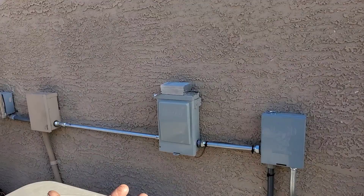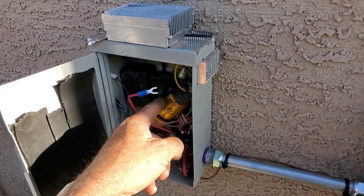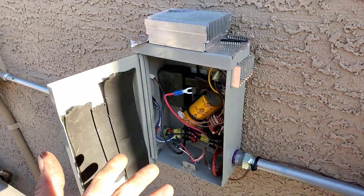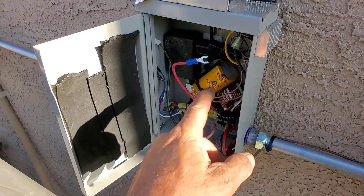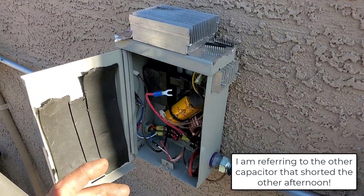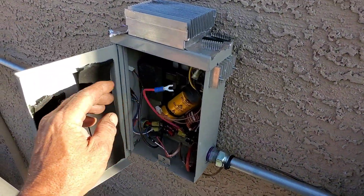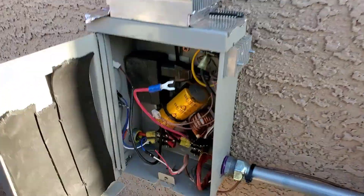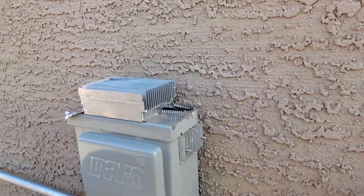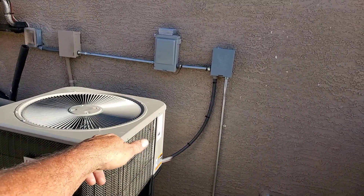Right now my electronics that I was working on are all just neutered and disconnected. Somebody was talking about the capacitor voltage being too high. Well, this capacitor comes off an LG board that's made for 208 or 230 volt input, but you get about 330 volts DC. When it's not running and the solar's hooked up it goes up to about 360 — but 400 working volts right there. Same exact capacitor. Except I had used soldering paste for pipe and it was smeared on top of it — I think it actually conducted somehow and it got that little plasma explosion. So the rectifier is all disconnected because it's shorted out. On to the next revision of that — it's just back to the way it was where AC is going to the VFD, the VFD rectifies it internally and charges the capacitor bus.